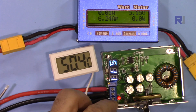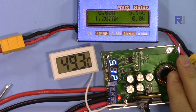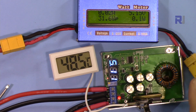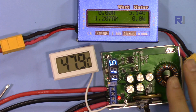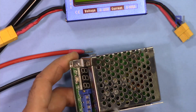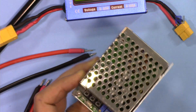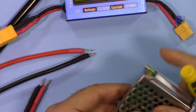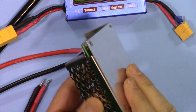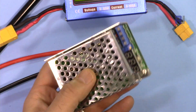In conclusion, this step-down buck converter can handle 7 ampere continuously. I tested it at 30, 24, 15, 12, 9, and 5 volts input, getting all standard output voltages down to 3.3 volts at about 7 ampere — over 200 minutes of total testing. The display design is poor as you can't see it from the top, but if you just need a reliable buck converter the device works reasonably well, and the thicker lower section acts as a good heatsink at 7 ampere.